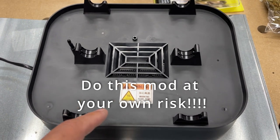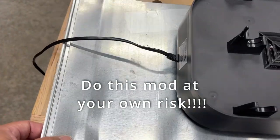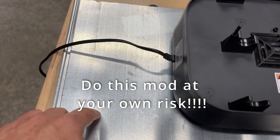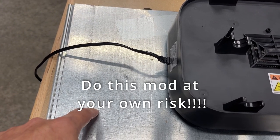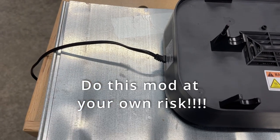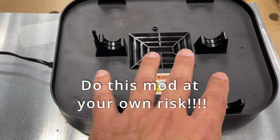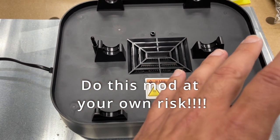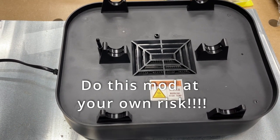I'm going to do some measurements. I found this old sheeting — I have a bunch of heavy gauge ducting I used for my dust collection system. I undid this and kind of flattened it out. If I cut this and make a little shield that goes over here, it will deflect the heat out around the filament rather than the heat going right on it. I think that might actually work.